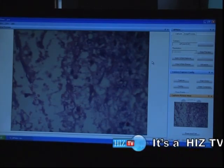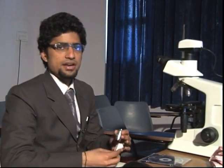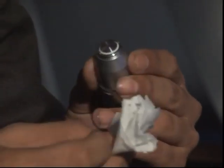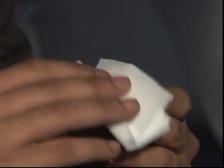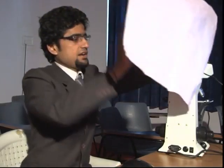This is how the whole software is used for the microscope. The image can also be directly seen through the eyepieces. For long-lasting use of the lenses, if harmed by some kind of oil, they are cleaned with acetone — applying acetone on tissue paper and then cleaning the lenses. For long-lasting use, the microscope is switched on and off properly after use and then covered to protect it from dust.